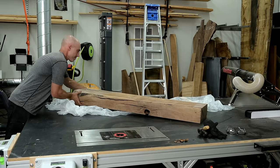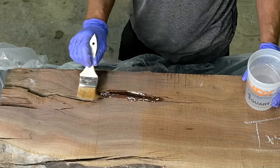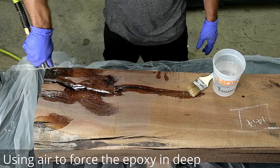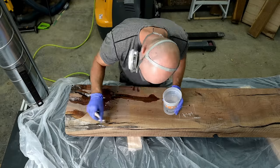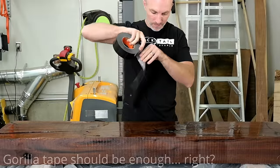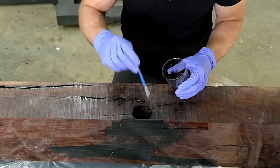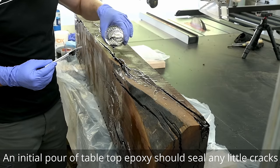I was a little uneasy about the idea of a wood and epoxy fireplace mantle. We talked about it in depth — I told him heat and humidity fluctuations could cause the wood or epoxy to crack over time. He told me the temperature fluctuations wouldn't be as much as I thought. In the end he accepted the risk of any potential cracks. Fast forward a couple years: that mantle is still in perfect shape. He liked the look and commissioned this second half of the walnut log as his personal fireplace mantle.